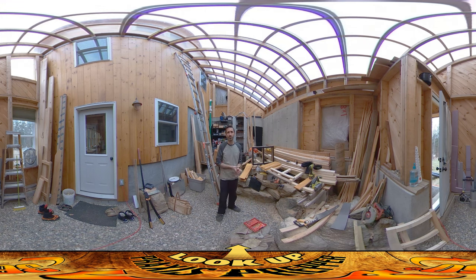We're not super high energy use people but I still use electric ovens and all those other things, and today I was using a table saw. I wasn't sure how much the draw was on the table saw so I checked it out — I ran it for a few seconds with Amber watching the meters inside. The table saw spun up to about 2,000 watts right at the beginning and then settled out just under a thousand watts, well within the system's ability of 6,000 watts to run it. So it's great — I can run power tools, I can run everything, and it's working out really well even on days that aren't super sunny.